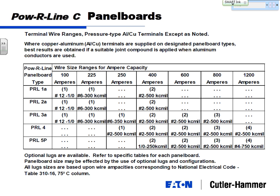Todd, do they make lugs on the low voltage rated for 90 degrees that you are aware of? That's a question I was asked one time, because in the medium voltage, yes, they have 90 degree. If you came across a panel board or switchgear that has lugs rated for 90 degree, circuit breaker or... Not on these mechanical type lugs that you see in these breakers, but I think there are compression lugs. So if you get a big lug landing pad in a switchgear or switchboard, I think you can find a compression lug that carries a 90 degree C rating.